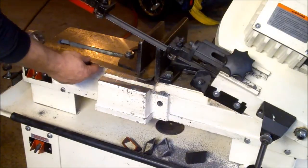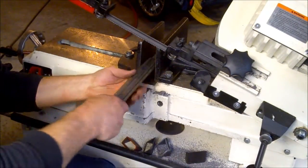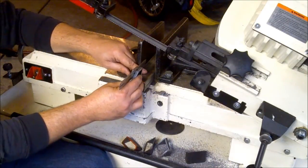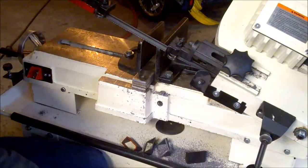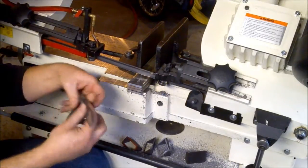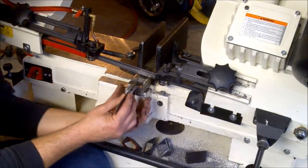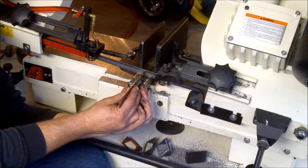Set in and put the saw back at 90 degrees. Now I'll do a gang cut — just set it in there. My square is set to inch and a half so these parts come out inch and a half square. I'll run the material in until the end of the blade touches the saw, then go ahead and do the cut, and we'll get inch-and-a-half wide parts.